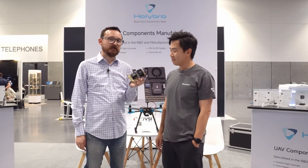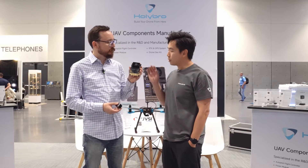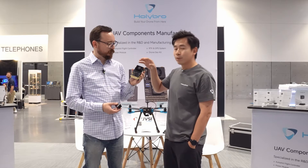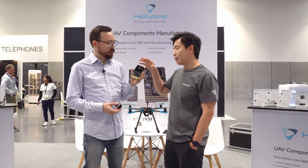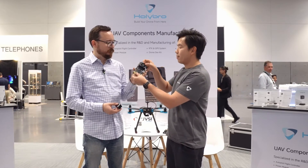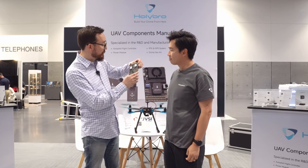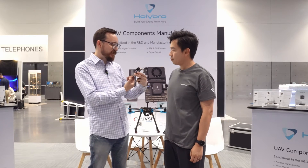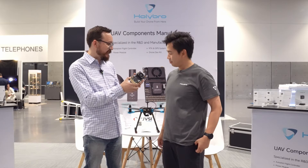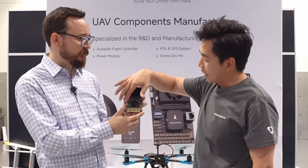This is essentially a complete autonomy stack running on top of PX4 and Pixhawk. You can buy it as a standalone baseboard and put in your own Jetson — it's designed for the Jetson Orin NX and Orin Nano, and partially compatible with other Jetson modules. You can also get a full kit with Wi-Fi and an SSD. There's an M.2 port, Wi-Fi, Ethernet, USB 3, and standard Pixhawk breakout connectors.